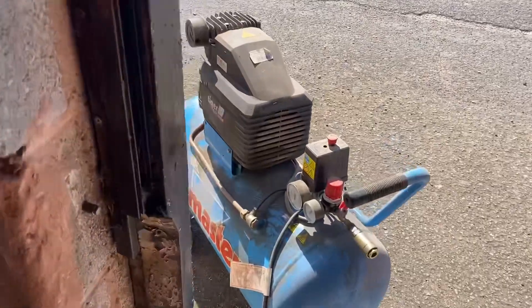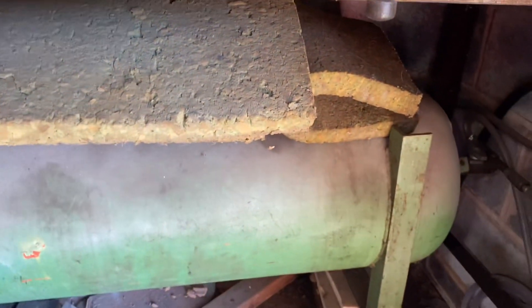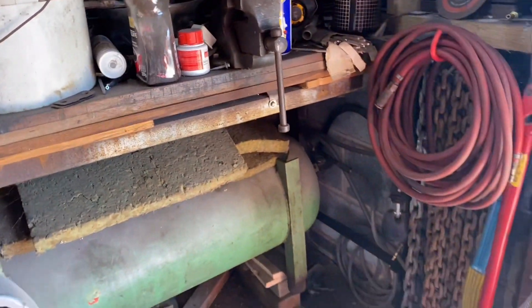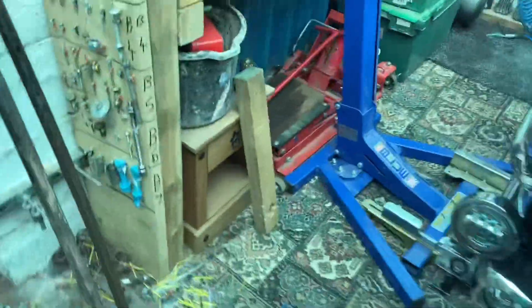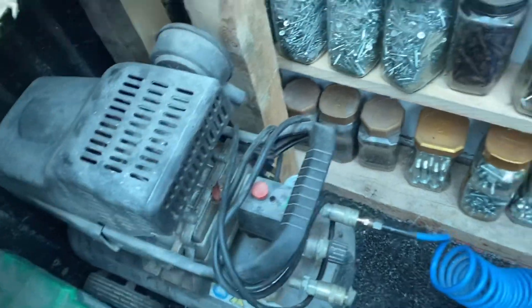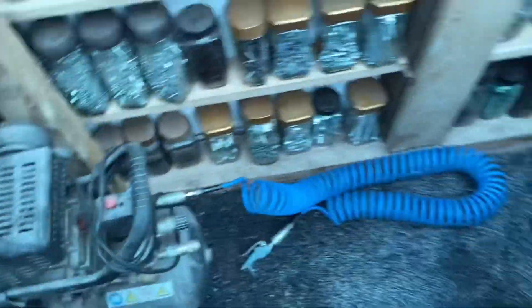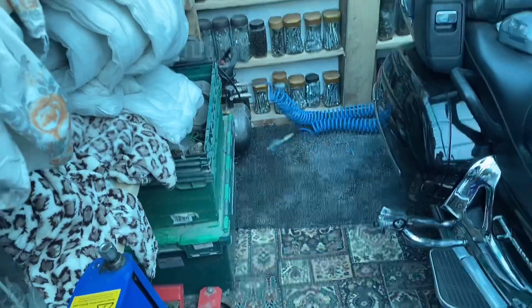So it's called charging your tank. I've got pressure in that tank but not volume. What I use is this tank for volume - it's just an empty tank that I connect the little one to. Then I connect through the wall; I've got another little baby compressor here. This little baby compressor tops me up - the blue one does 90 PSI and this brings it up to 115 PSI. I've also got air here should I need it. Do you see the lead that goes through the wall? That connects to the top-up compressor, because when you're working in the garage you don't really want the noise in the same room.